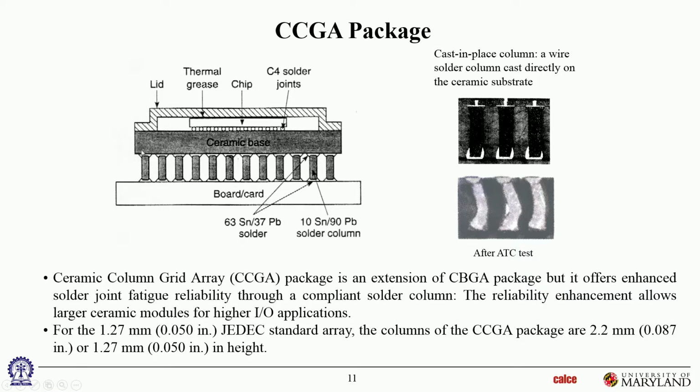Here's the slide for it. So now, instead of solder balls, solder columns have been soldered onto the component with eutectic solder, and then you would solder it again on the PWB side when assembling the board. And you can see cross sections of some column grid arrays. That's the joint on the component side. This is the joint on the PWB side.